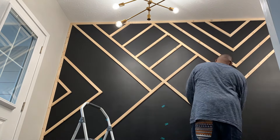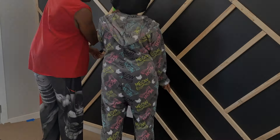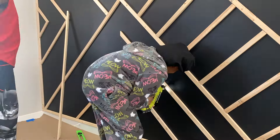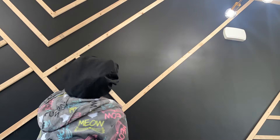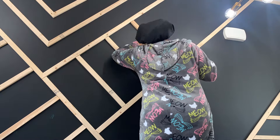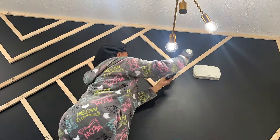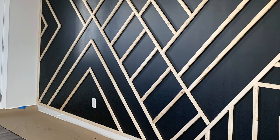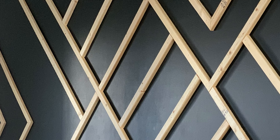Can you tell I've got short-girl problems? The husband had to help me when it came to the ceiling — these are nine-foot ceilings. I had a step stool and I was still too short. What we're doing here is framing out the entire wall. Some people don't frame their walls with this type of accent wall look, but I wanted it framed. We used a nail gun and the saw. I had a laser level but ended up returning it — it was not helpful at all. We used one-and-a-half-inch nails for the nail gun; my husband said they'd do just fine, and we haven't had any problems.